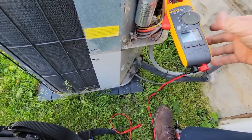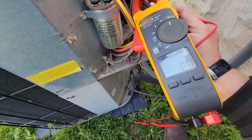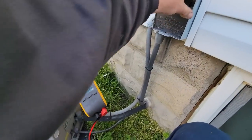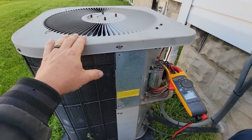Alright, now there's that. If we're lucky we'll have amperage; if not, we're screwed — nothing. So it might be a wire burned off at the compressor. Let's pop this top and take a peek in there and see what we've got.